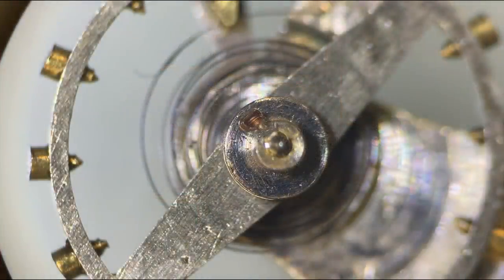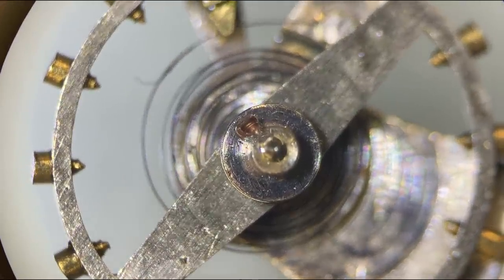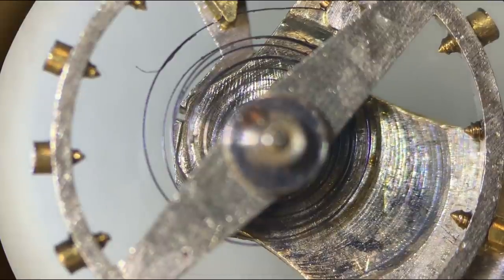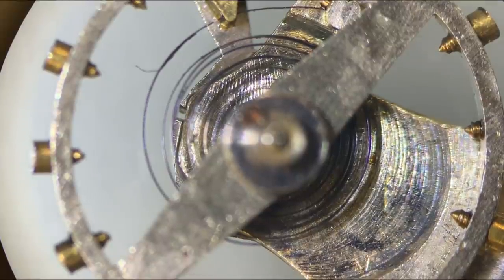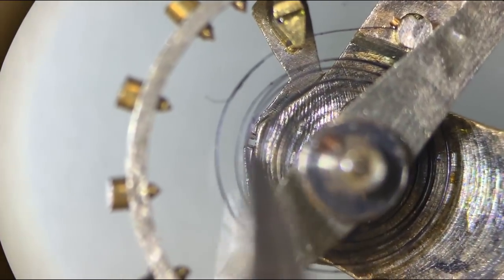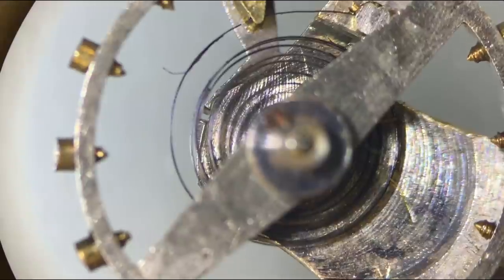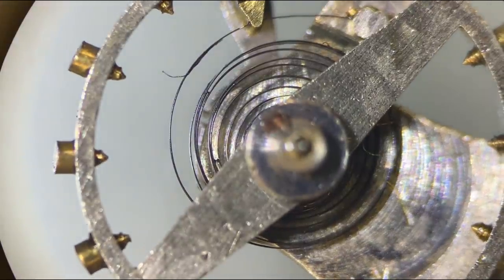So here we go, that's the pivot, the top there, we've got the little impulse jewel. And then of course the hairspring, and it's also got a hair on it. How apt is that? So what this does, it's quite difficult for me to get in here with the way I'm set up, but a hairspring, you can see, just all stuck together, not doing anything very well with those coils. Now, I've got specialist hairspring degreaser, which is called essence of Renata, which I talk about a lot in some of my videos, and this is going to need a massive dunk in that, that's for certain,